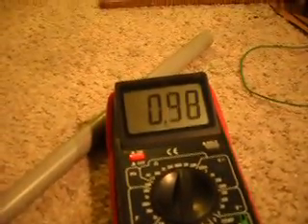I pull this back down — there it goes. Perturb the system — there it goes, it's now oscillating. I'm going to turn up the voltage until I get some sparks. There we go. It's actually so powerful, even at low voltages, that it's causing sparks to jump across the secondary. That's way more than that neon sign transformer can do.